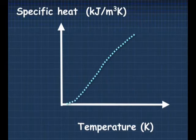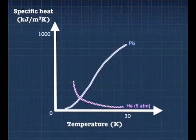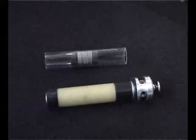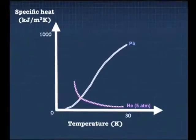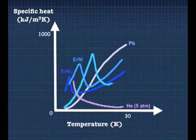This automatically indicates the problem. As lead goes down and helium goes up, you have a problem in your heat exchanger and your regenerator. For that reason, standard coolers stop at about 10K. What you need is regenerator material that has a much higher heat capacity than lead. These materials have high heat capacity because of magnetic transitions in this temperature range, and they also get peaks in heat capacity due to the phase transitions.